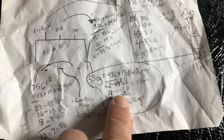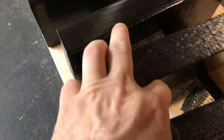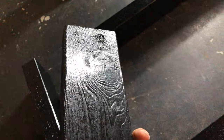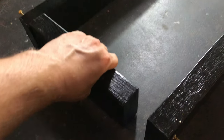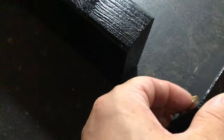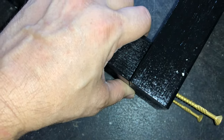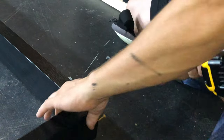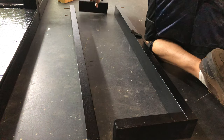Now those are all prepped and ready. To build squares we're going to need some side pieces — I've got three for the bottom and four for the top and middle at 10 inches. When it comes to building these squares, get your front and back and two sides, pick the best side — kind of like that peacock look. Keep it tight, keep it right. Put it up there, make sure it's even and plumb, and if your measurements are right it should square itself up.